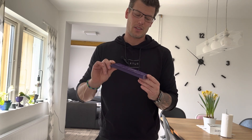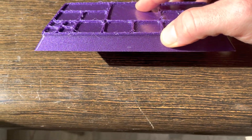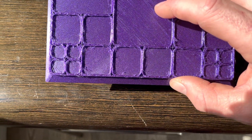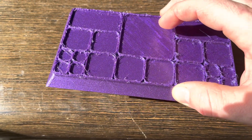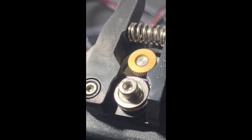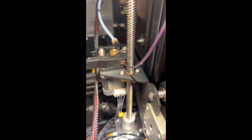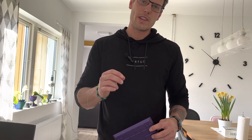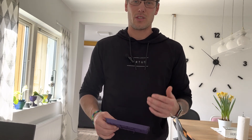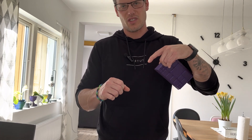After eight hours of printing I had to cancel it. As you can see here it started out great but then suddenly it didn't connect the filament. The reason why it pops back out is because the extruder is probably clogged up — it's pushing in the filament but it's not going through, so it bounces back when there's too much tension on the nozzle.